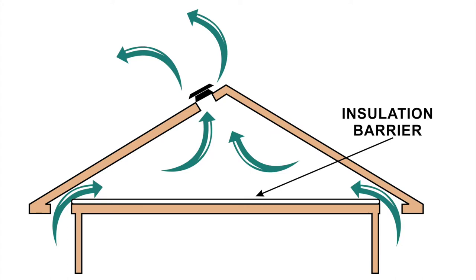I want to look with you at this diagram, which shows what your attic ventilation is supposed to look like. You can see that at the lower portions of the overhang there are vents cut into the roof that allow cool air, especially in the winter, to get up into the attic space and force any warm air up and out through the upper ventilation.